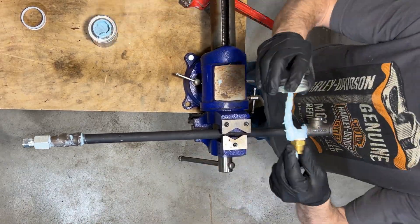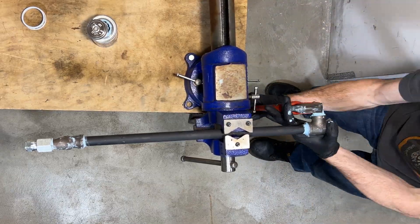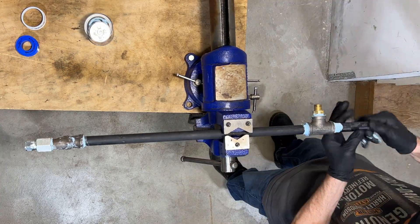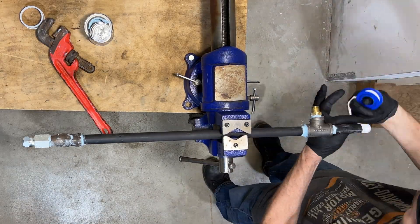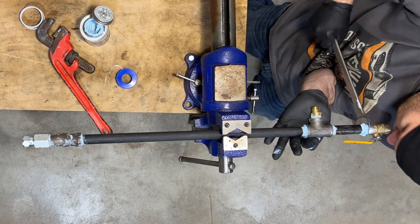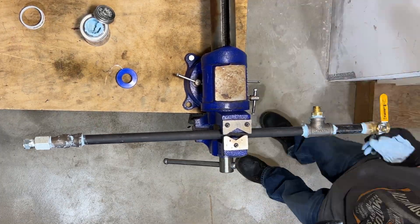As you go along, you'll need to be careful not to move the existing pieces while tightening on the new pieces. Otherwise, it'll mess up the direction the fittings need to be positioned in order for it to lie flush and be lined up correctly. The bottom of each pipe will have a bulb out at the end of it. The black iron collects condensation and can be drained at the bottom of each line. This helps catch moisture and keep the air dry. It's a pretty messy job, so be prepared for lots of cleanup throughout the process.